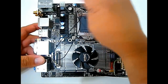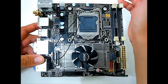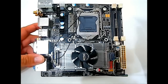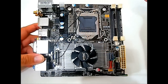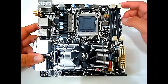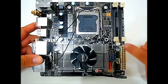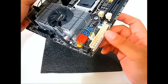At the top of the board you can see the USB 3.0 header, and there are also USB 3.0 ports at the rear, giving a total of four USB 3.0 ports via a VIA chipset. There is a four-pin CPU power connector — the Z68 ITX-A uses an eight-pin connector because it is designed for overclocking, but this Supreme version uses four-pin. Here are the dual-channel DDR3 SO-DIMM slots, and above them is the four-pin CPU fan connector.